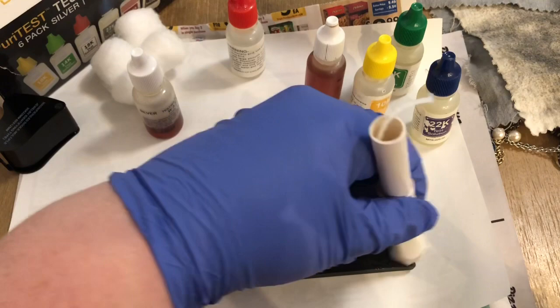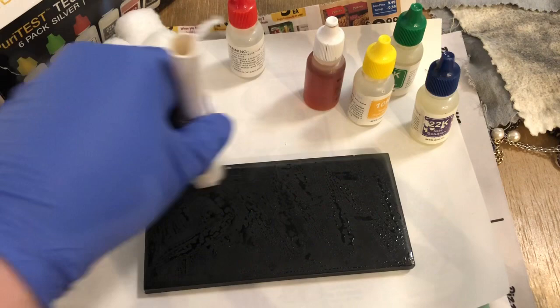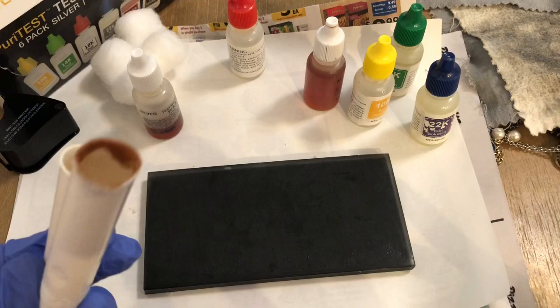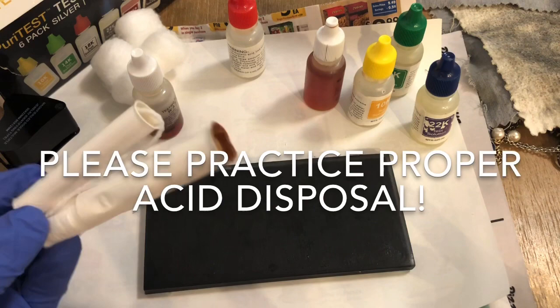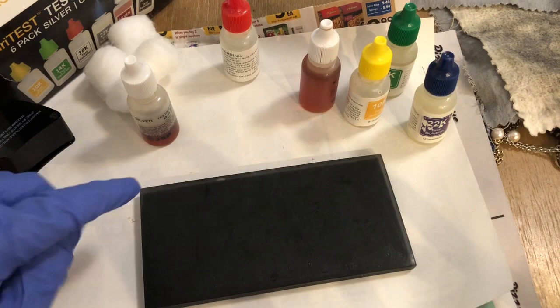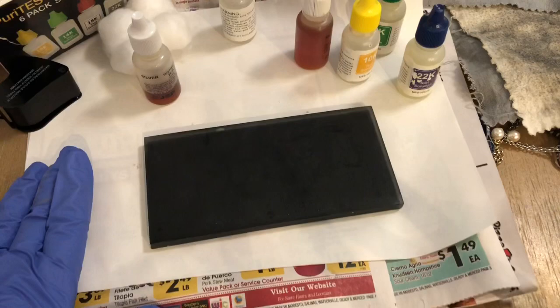Once you feel like you have all the scratches off, pull the tampon out a little bit and wipe the excess. A handy trick: pull the cord back in, and the cord covers the used end — you can toss it without touching any acid. The acid dissolves into the cardboard, but the cardboard is thick enough that you can just put this in a baggie and throw it away. It's important to let the board completely air dry — you do not want any other acid on here. Also make sure the lid is closed tight on the acid so you don't knock it over.